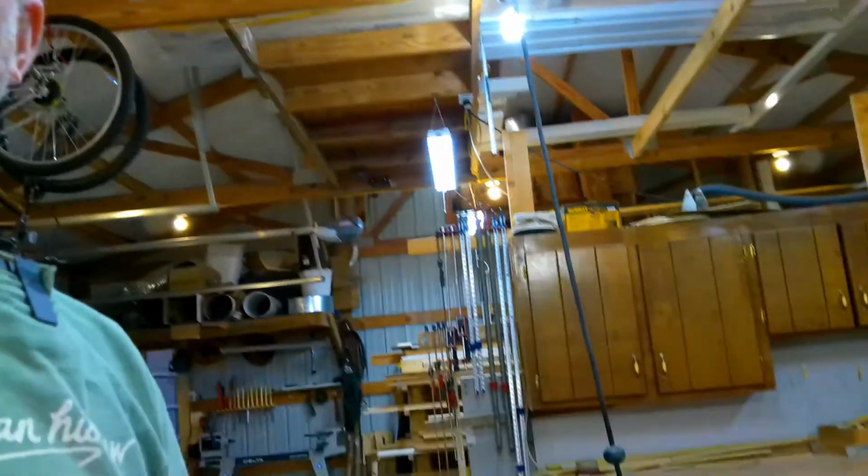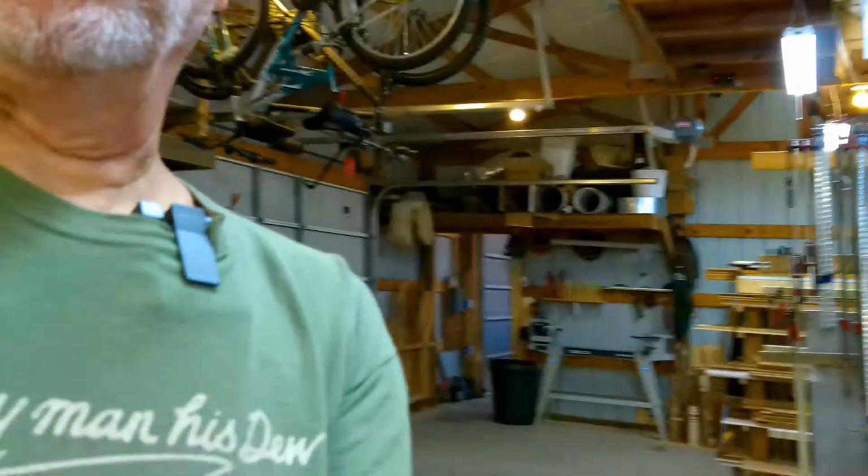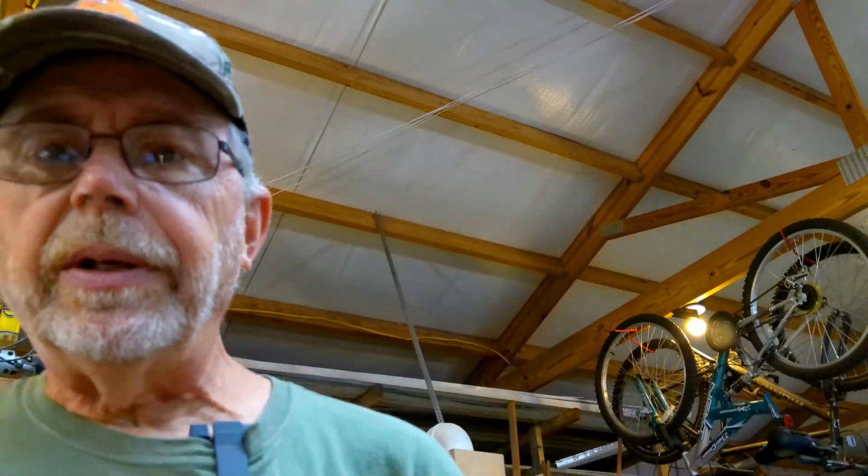First thing we need to do is, this one here is yellow wood. You can get whichever ones you want. I should show you, this one here. It does give us dimensions. Basically the whole material list is 4 8-foot 2x4s, half a sheet of half-inch plywood, 2 4-inch carriage bolts and nuts, and something to finish it with. You can do whatever you want on it, paint and decals and whatever fancy things you want to put on it, and that should take care of you.